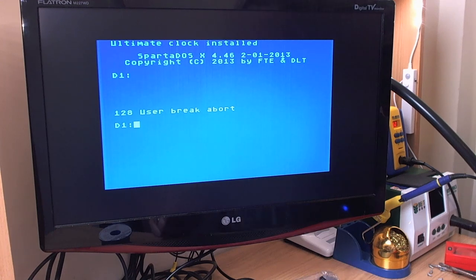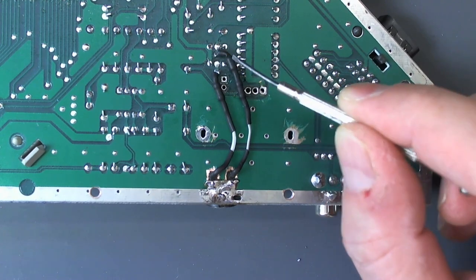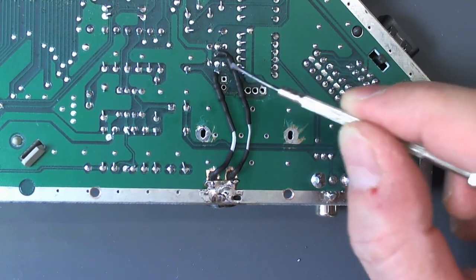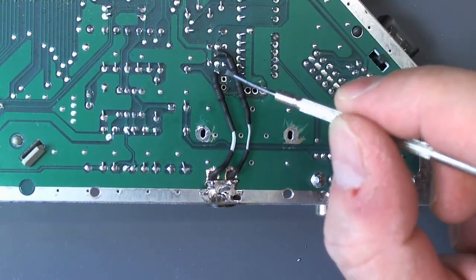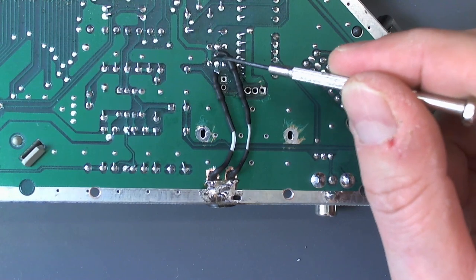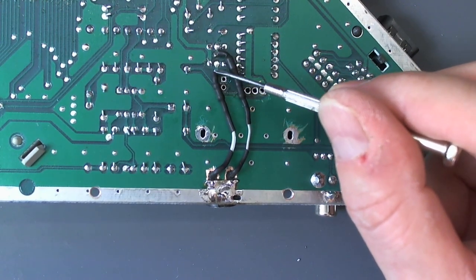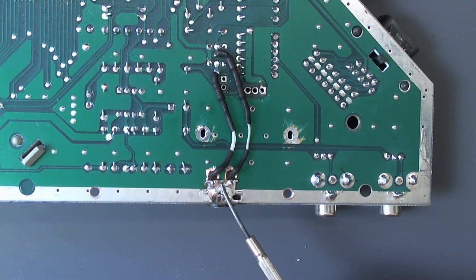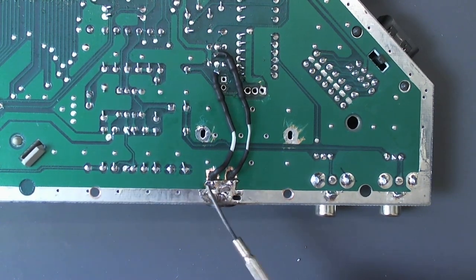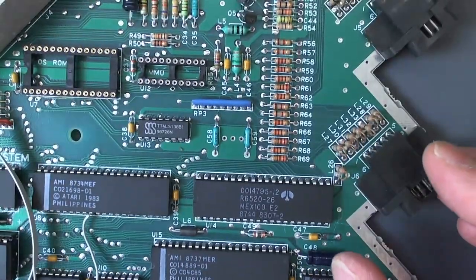I'll tidy up that wiring under the video circuit and put the machine back together. Here are the two finished wires. I did put a capacitor on this side of the resistor — it seemed to make a difference. I don't even know what value it is; it was a similar glass capacitor out of the spares box that you'd commonly find used as bypass caps on some of the Atari boards. You can experiment and see what results look best to you as it's quite subjective. So we've got the whole thing heat-shrunk: the cap and the 75-ohm resistor, another 75-ohm resistor for Luma, both going to the pins. I managed to flood-fill the whole area with solder, so I've disguised the mistake of grinding off the copper from the ground pins, and I think that looks perfectly acceptable.